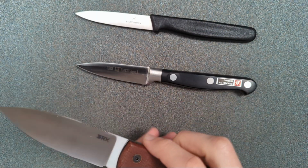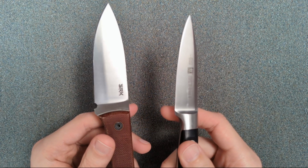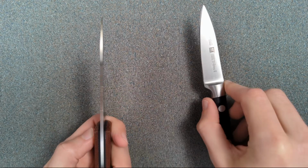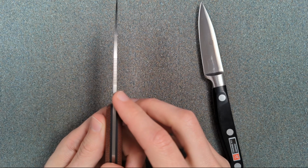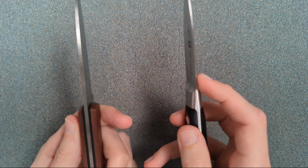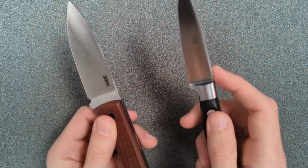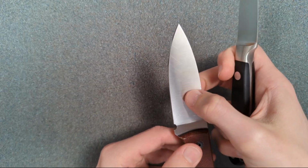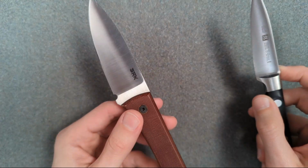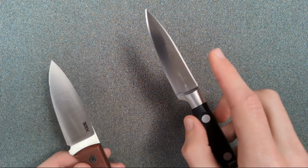Okay, we are back. And as I said, the reality is that the geometry on these two blades is tremendously similar for the portions that are actually the same size. This is just under 0.1 inch blade stock. It's 0.0965, and this one is down here at 0.065. That's 0.0965 and 0.065, a 0.03 difference. But if you measure the thickness here at the height of this, this one's 0.065, and this is 0.075. So they're actually tremendously similar geometry, the entire path up. This one just ends earlier.